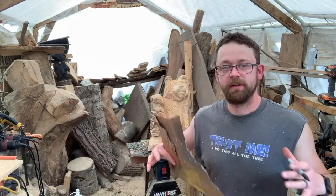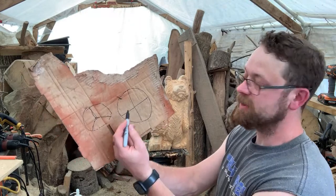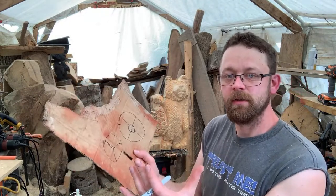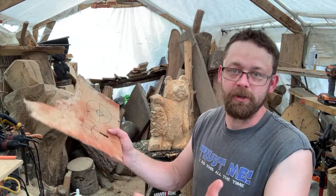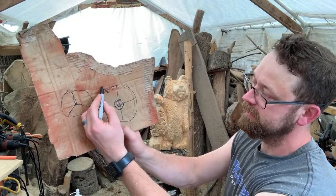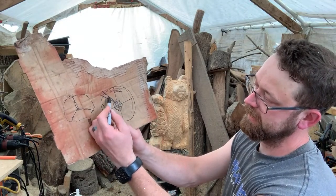If you're carving from solid logs, the outside dries faster than the inside, okay? So the exterior of the log is going to dry much faster than the interior. If you don't know, dry things shrink. Wet things full of moisture stay bigger. Sounds weird, but you get it. So we've got all this moisture in here, and this is drying, so it will start to develop a crack and pull apart. Then we end up with this crack.